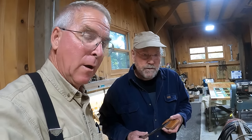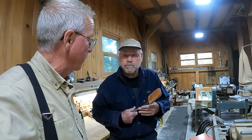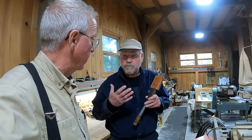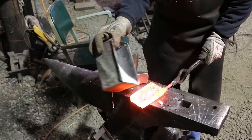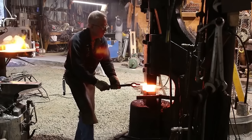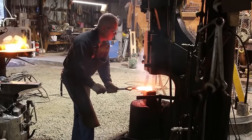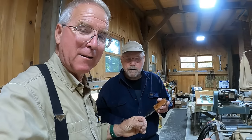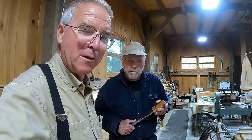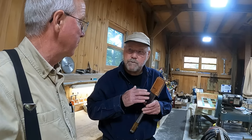This guy's mastered his craft, and he's online, and he has really come to the front as far as timber framing hand tools. It's interesting. I've asserted, and probably will continue to assert, that Damascus steel, pattern welded steel, is entirely for aesthetics. In the world of blades, knives and swords, I've got to say that's true. But here's a case where welding different alloys together in different thicknesses achieves a better, more useful tool. And that, frankly, is energizing for a blacksmith to hear. The Japanese would make their chisels the same way, and this is derived from that method.